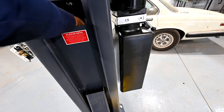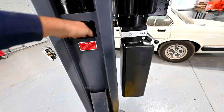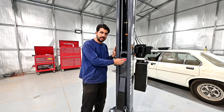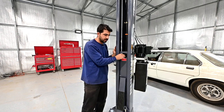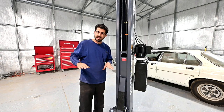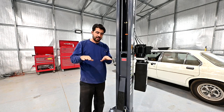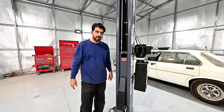When it was time to put that end of the cable inside the bracket you really have to reach way down in there to put it inside. The way these cables work is you can lower or raise one head in relation to the other by way of this nut — you can unscrew it to lower the head, screw it in to raise it. That way you can make adjustments and make it exactly level so that when the car goes up and down it's going up level and smooth, which will keep you safe.